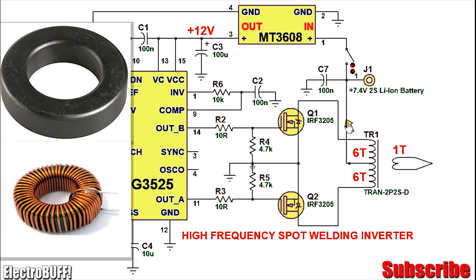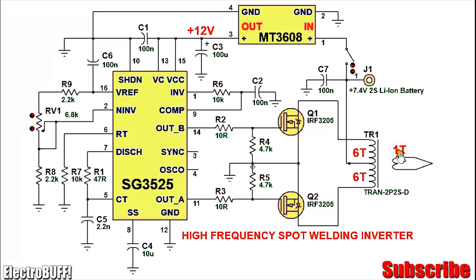For the transformer, it is a ferrite core transformer, preferably a toroid core. You can easily find these as output filters in many switch-mode power supplies. Just ensure that it is relatively large enough — for example, I recommend one with an internal diameter of at least 1.5 cm. For the windings, the ratio is 6 to 1, so the voltage is stepped down roughly 6 times but the current will be stepped up by about 6 times. The primary winding is made up of a parallel arrangement of fine enameled copper wire. For example, if you have 0.3 mm diameter enameled copper wire, I recommend paralleling about 15 strands, wound 6 times in one direction and 6 times in the other direction. The midpoint is connected to the positive of the battery as shown.